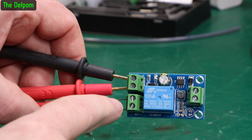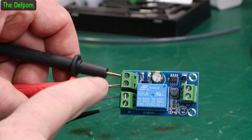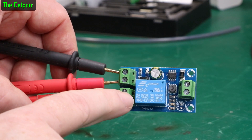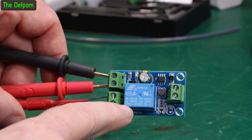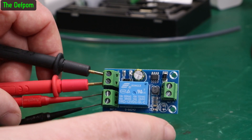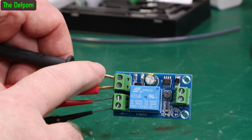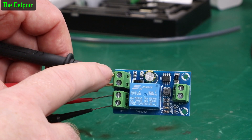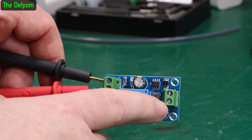You've got the outputs over here — 12 volts to 24 volts on these connections. If this one drops off, it will switch over to this one automatically and continue an output. Now what I've found: relays always have a changeover time with a single pole relay. The turn-on time is about two milliseconds changeover. So if you're running from this one and you switch over to this one by connecting power to that, the changeover is about two milliseconds — you lose power for about two milliseconds on that connection.